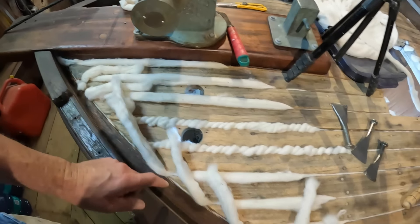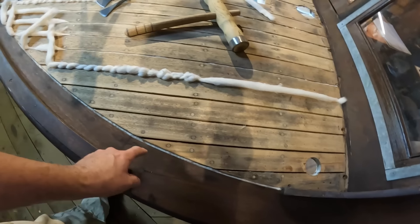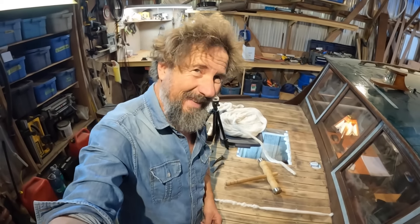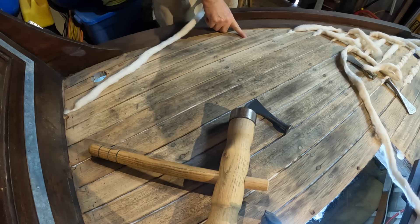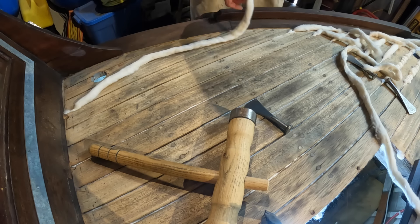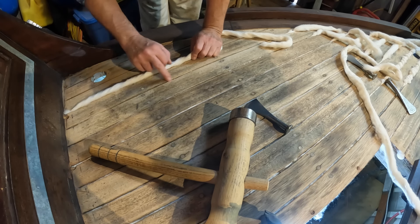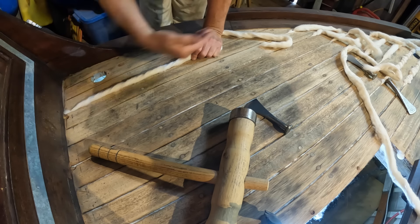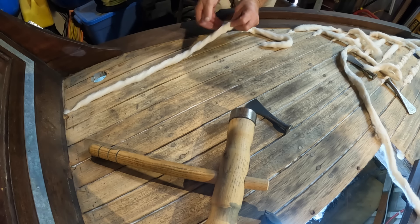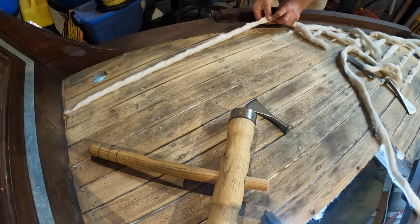I haven't finished off any of these because really these should be done in the direction of weaving in. However, I'm caulking the deck in this direction, so once I'm finished down here, I'll just weave them all in up to the end. Other than one blowout — which was completely my fault, I hit it too hard — this is going really really well. Now this seam is a little different — halfway between the tightest possible seam and one that needs to be fully knotted. So for this one, I'm going to twist the cotton. Twisting reduces the number of fibers caught along; if it's twisted, more of the cotton runs up and down and less along, so when you drive it in, you have fewer loose hairs to deal with later. But it does mean it's a heavier, denser roll of cotton, and in some seams that's just too much.